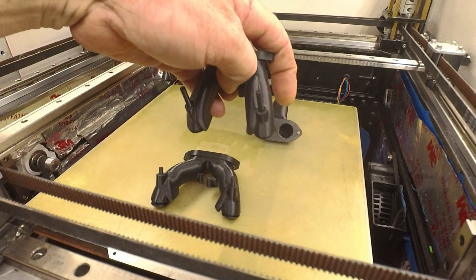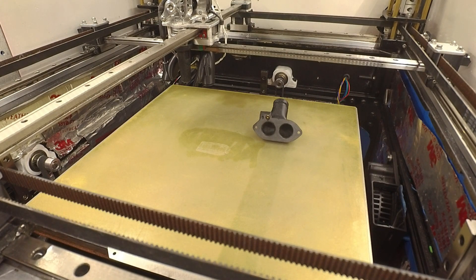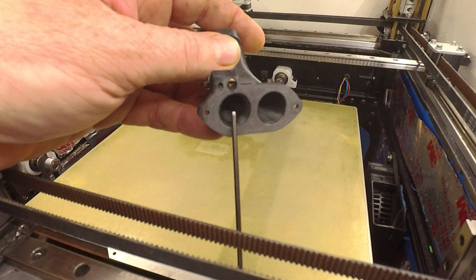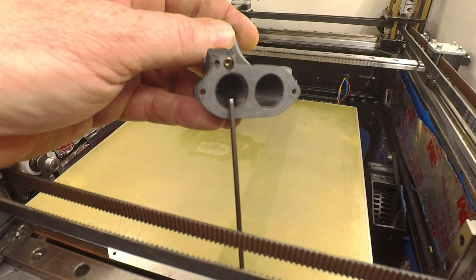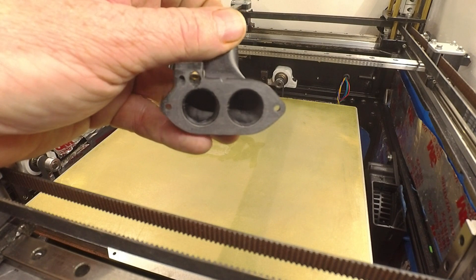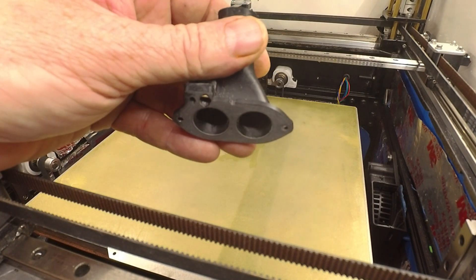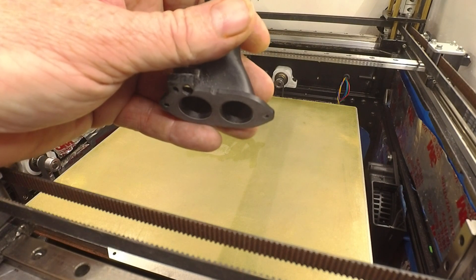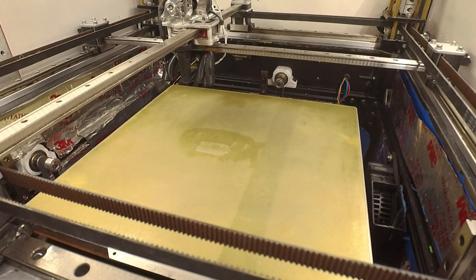Using these changes helps quite a bit. I've had to increase the temp another 5°C on the Benchy and I'm running it faster. This is the back end — the new one has holes that go all the way to the outside edge, the same 20.5 millimeters on each side. So let's go ahead and print an eight-minute Benchy in PLA and see what it's like. We're looking at cooling, any ringing or layer quality issues — is it my machine or is it cooling? Let's see what it does.